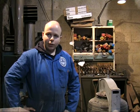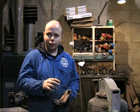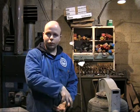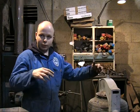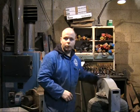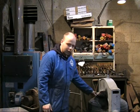Well, in the tower we have a jig which clamps onto the bell and a very powerful mobile drill. Due to the size of the bells, we decided to leave them in the tower and take all the kit upstairs with us. So we can clamp the jig and the drill in place and just drill straight through. And then we can also balance the bell as I did just now in its own frame. And then with the stocking down bolt through the headstock and the bell, again, we can use the same jig and the same drill to drill down through the four holes of the bolt. We also have to cast resin pads on top of those two bells. So that will be done in situ, left to set, and then we'll come back and finish.